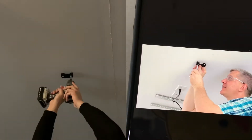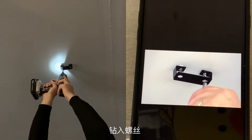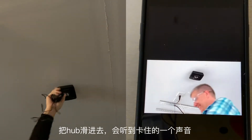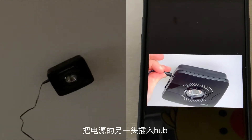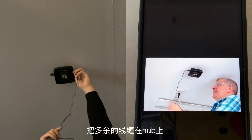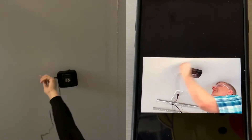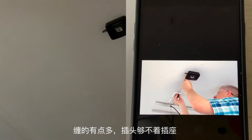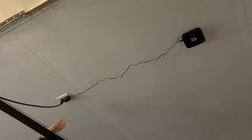Make sure they're flush with the surface. Line up the bracket holes to the wall anchors and use the screws to secure the bracket to the surface. Slide the smart garage hub onto the mounting bracket until you feel it snap into place. Plug the cord into the smart garage hub. If there are extra cords, wrap it around the bracket until you have just enough to reach the outlet. Plug the other end of the cord into the power outlet and wait for the solid green LED on your smart garage hub. Great job!